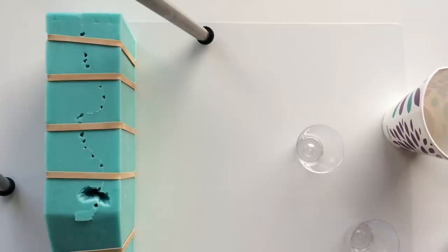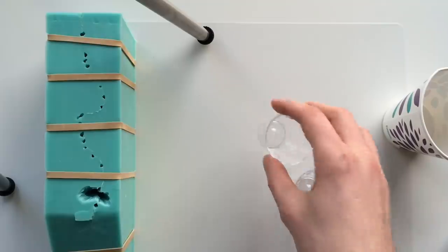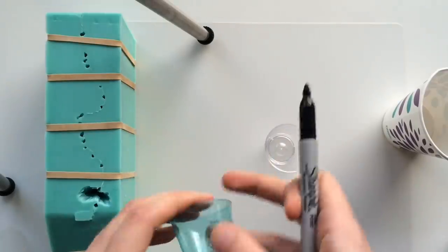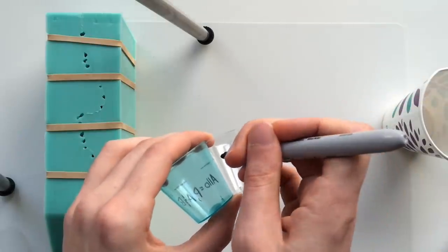That way I could fill two cups with water, and then subtract that amount of excess to know how much resin I used, divide that in half into a little disposable measuring cup, and I had 25 ml. Mark that on the disposable shot glass, and now each time I'm going to cast, I match up that Sharpie line.